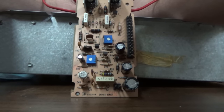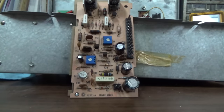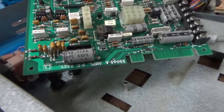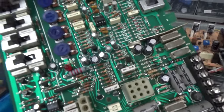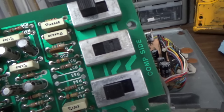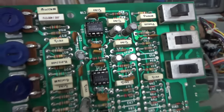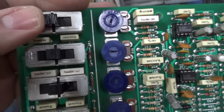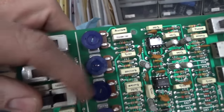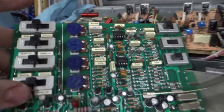Let me try on this one up here that's in circuit. Look what we have here — the amplifier PC assembly. So the AVC is made like that — they just have it so you have to put a screwdriver in there to turn that on and off. So yeah, this is where it gets a little dicey. My idea of just shotgunning the caps might not work on this — there's like 100 caps.